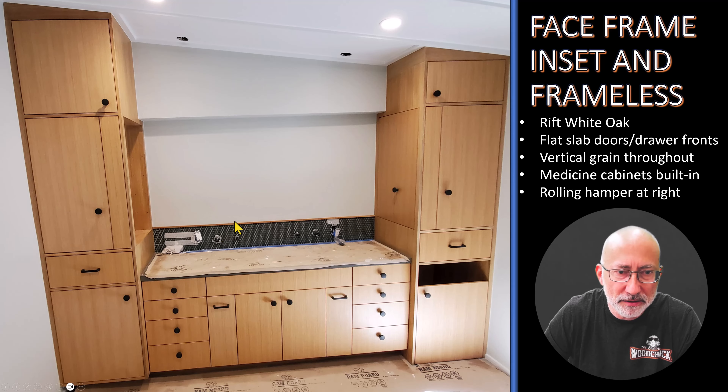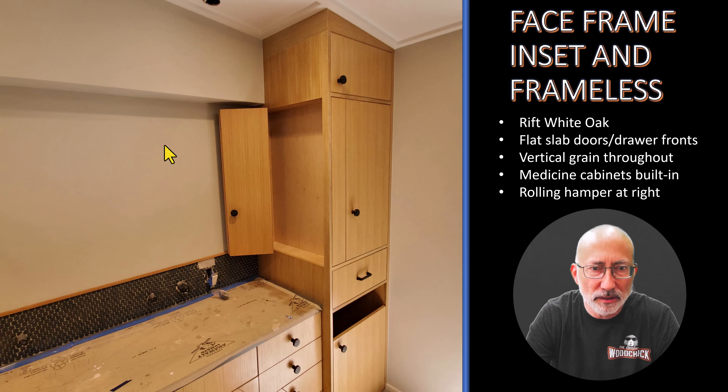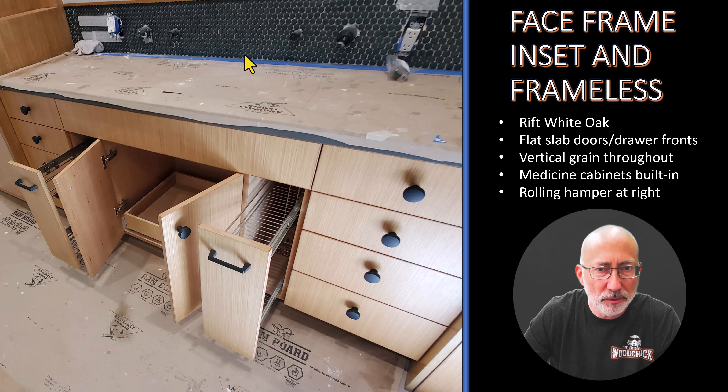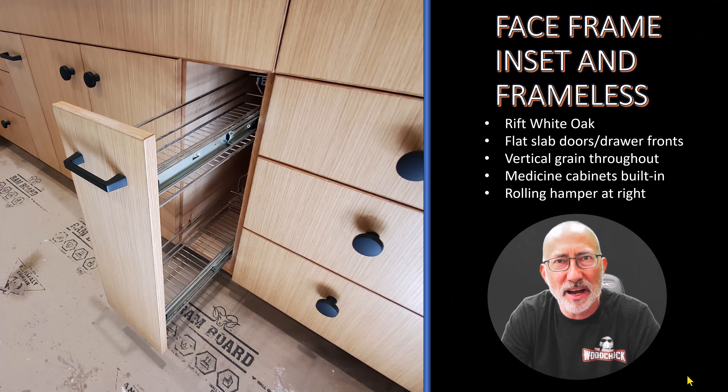Here I added this wood piece on top for the tile before they grouted. You can see how much different it looks with knobs and handles. There's that bifold door, and how it's all fit to the ceiling. Here are all those pullouts in the base. Every one of these drawer fronts has an eighth-of-an-inch solid wood border going around them rather than a very thin veneer — so that's another way you can change the look. You can see that eighth-of-an-inch border on these doors and drawer fronts in this closer-up view.